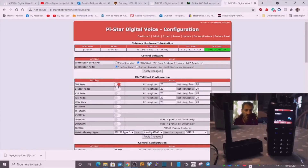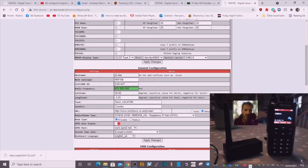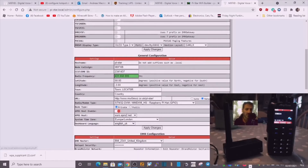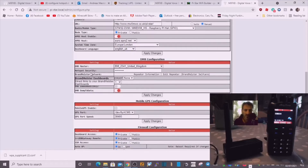Once you've signed in correctly, click sign in and I'll show you what settings to put in the config. You want to turn on DMR here, put in your DMR number and the frequency the same as what we put in the radio — your DMR number and your call sign of course — then apply changes. Once applied it will ask you to select the modem type: select STM32 DVM / MMDVM HS Raspberry Pi Hat GPIO. Apply it again — it takes a couple of minutes each time for this small JumboSpot.